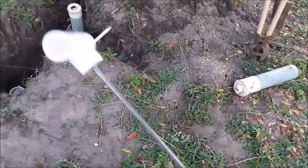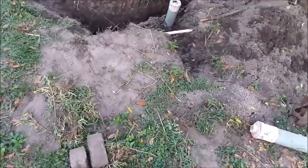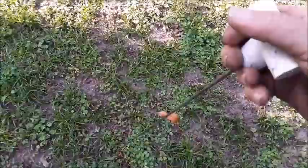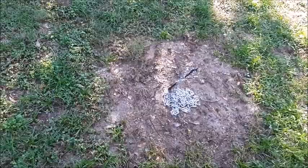You want to make yourself a probe. We took a half-inch T and a long piece of rod from Home Depot or Lowe's, used a little bit of Bondo filler to cement the rod into the T, put it on a grinder, and put a pointed tip on the end. From where your septic tank is, where the pipe comes out, stab this down into the ground, and when you hit something you know that's a drain field. Move around to find the perimeter. When you're away from the drain field, you should be able to shove the rod all the way down without hitting anything. Mark off the corners of the existing drain field because we're going to leave that intact and hooked up, then add another leg to it to give it more longevity.